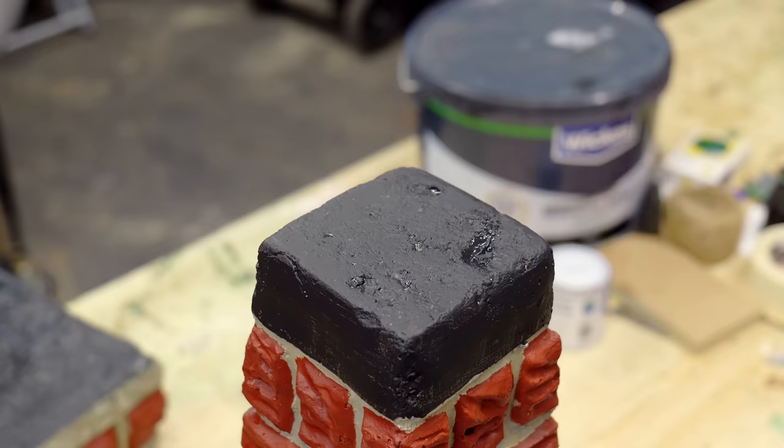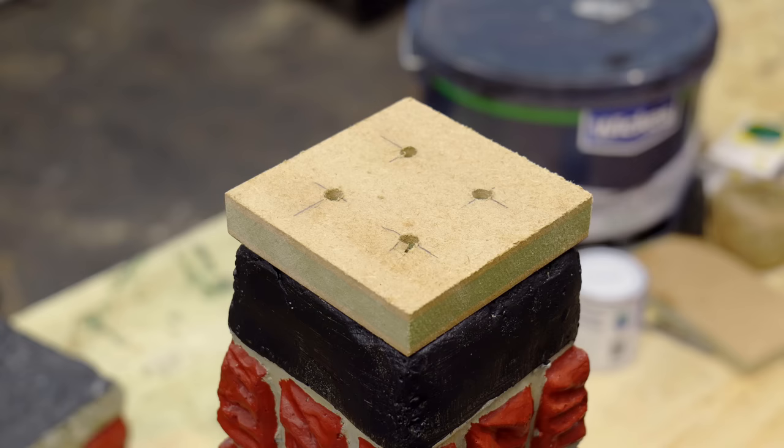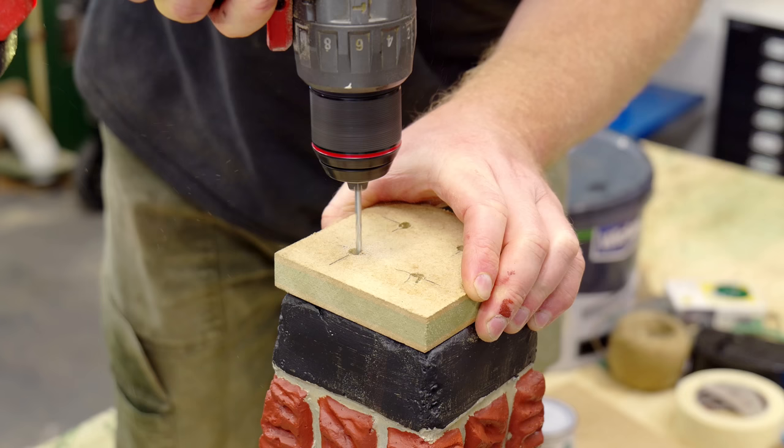This should fit nicely on the top here and I'm going to use this as a drilling template to drill four holes in the concrete, but I'm a bit worried about vibrations — I don't want to risk cracking or breaking the concrete, so I'm not going to use an SDS drill which is what I would normally use to drill concrete. I'm just going to use a regular combi drill and work my way up with the masonry bits. I started with a 4mm bit.